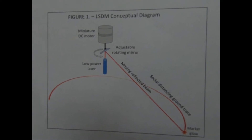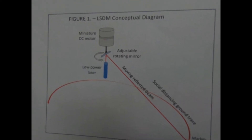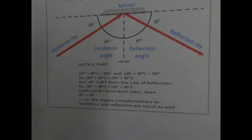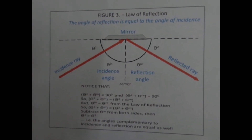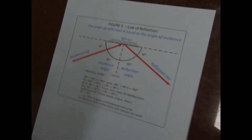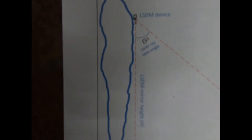What's the principle here? It's pretty simple — it's not rocket science. It's a DC motor, a five-volt laser, and a spinning mirror. The laser is vertical; it reflects off the mirror and hits the pavement. As the mirror rotates, it draws an arc — that's all there is to it. You might remember from high school science: the angle of reflection equals the angle of incidence. Using a bit of trigonometry, once you know the angle of incidence, you can literally point where you want the beam to go.